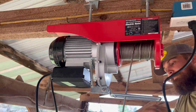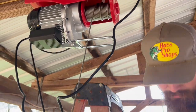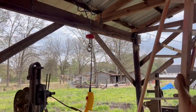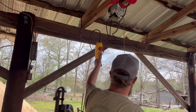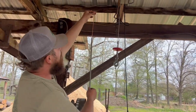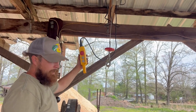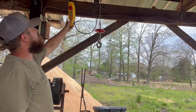She's tight. So this is kind of a how-to video — how to turn your logs easily. There's another portion of this that gives you the ability to turn the log. I'll bunch the cable up to where it's something I can reach and grab. I've got a spring and a string — check this out. It's a long spring. I'll tie that up on a bolt up there so it'll be springing but sitting right here out of my way. On some of my old circle mill videos this was hitting my head because it was back over here, in my way. Now I've put it directly over the carriage, and if I spring this up here, I'll have to reach for it but when I need it, it'll be out of my way.